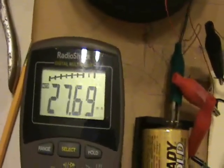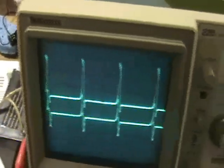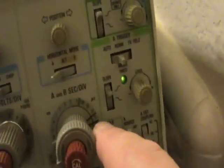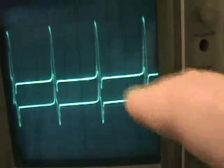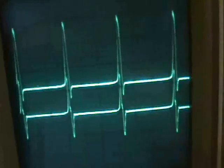Here's the current draw for those four LEDs. Back to the waveform — this works out to be about 15 microsecond cycles. It's on 5 microseconds per division, about three divisions, so that's roughly 66.7 kHz or so. The amplitude: both channels are set to 5 volts per division, so this one is about 15 volts peak to peak and this one is about 10 volts peak to peak.